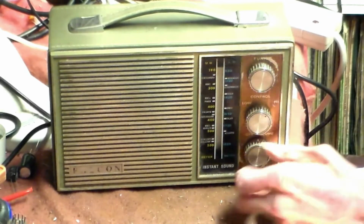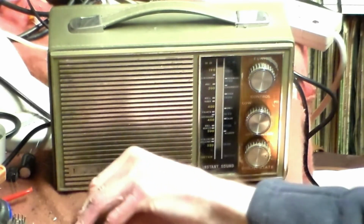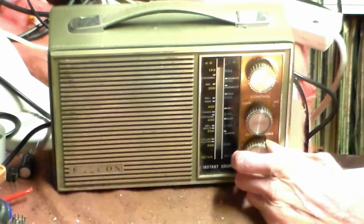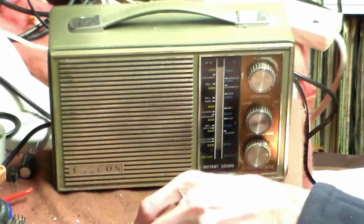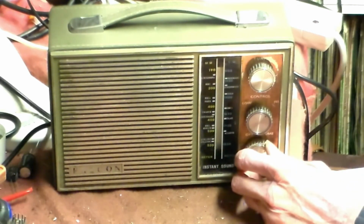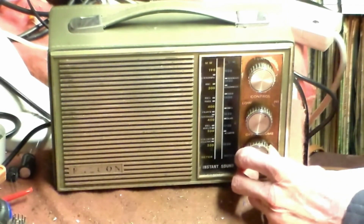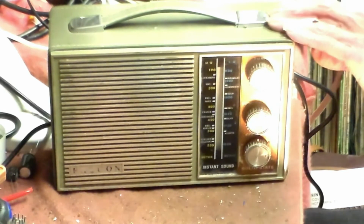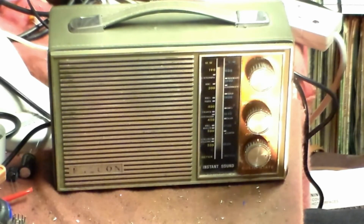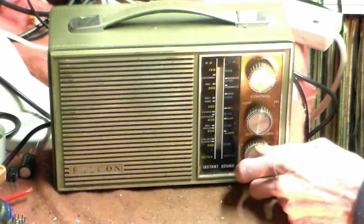It's an awful lot done to it for a cheap radio. And I suppose from the point of view of finances, it wasn't worth it. But what you learn from doing a radio like this far outweighs that. First of all, on this one, we've learned a few things, and each one, of course, is something which we'll use in the future. First of all, it came in with a faulty output stage, which I repaired and transferred to silicon from germanium by changing the resistance bias, as I showed earlier.